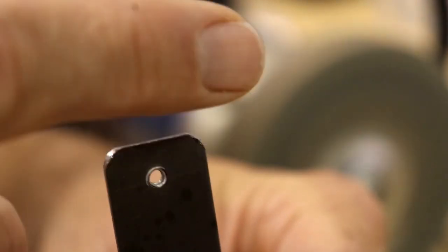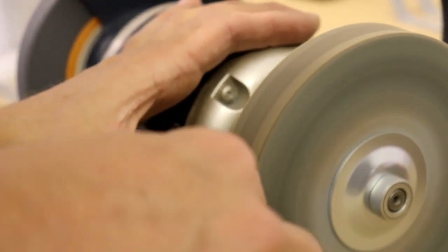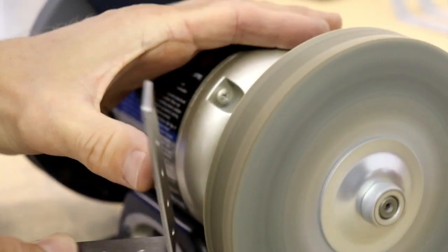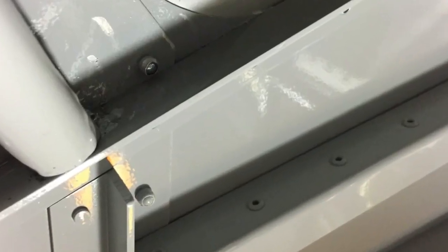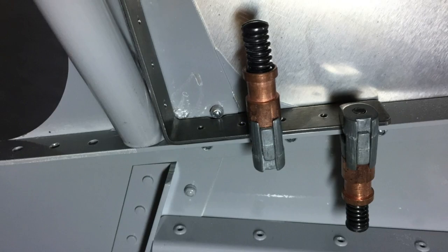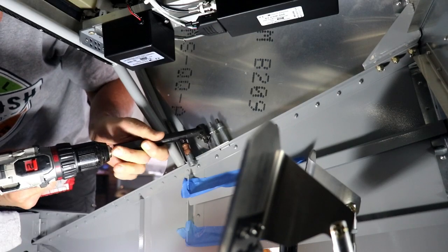Here you can see after I rounded the edges, that's what it looks like. And of course now you have some sharp burrs on there, which I'll grind off on this wheel. The first thing I noticed was this rivet interferes with the steel bracket on both sides, so I made a little notch out of the steel bracket just to accommodate that rivet. After that I added some tape so the metal shavings don't find their way into any crevices. After that it's just a matter of getting an angle drill and drilling out each of the holes.